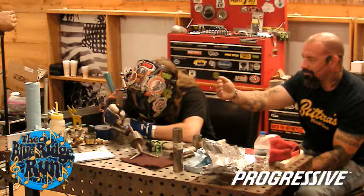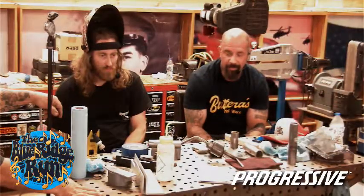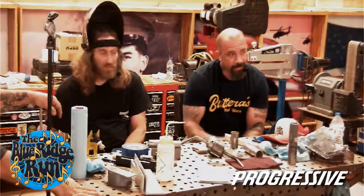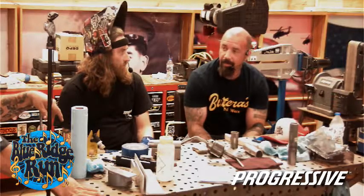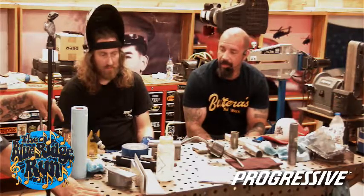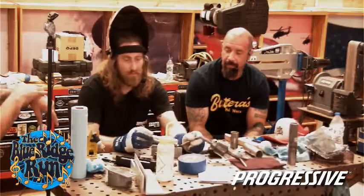Plus, he gave me a couple of those, so I'll definitely use them. I've bought the glass ones, and they're super nice. They're super expensive, and it seems like every time I get one in the mail, it drops on the floor within the first 2 weeks. So I've always used the standard pink gas lens. Probably the most old school thing there is, and to this day I think that's what I welded that frame with. So it works. The glass lens is nice for visibility, and the coverage is good, but I think you can set up your rig with traditional cups and accomplish the same thing, and save you some money along the way.